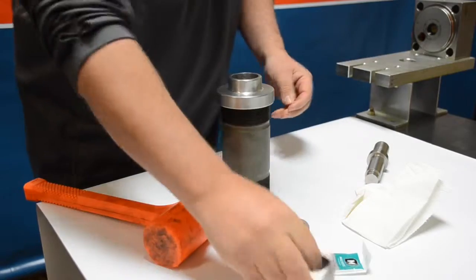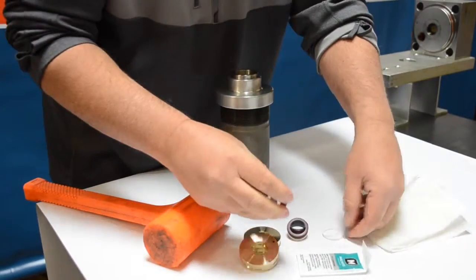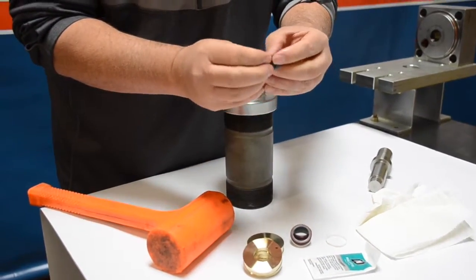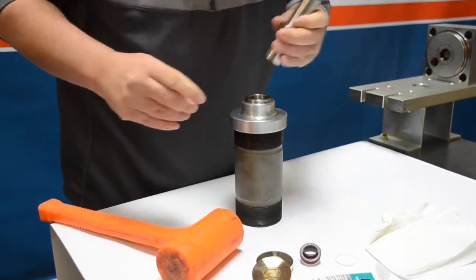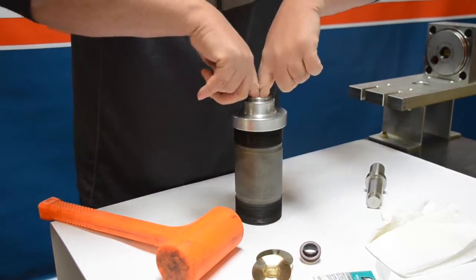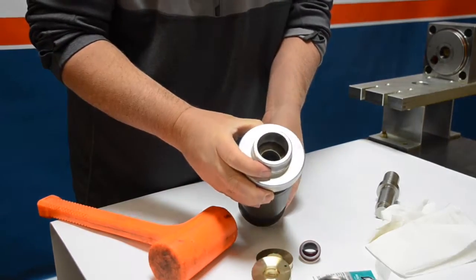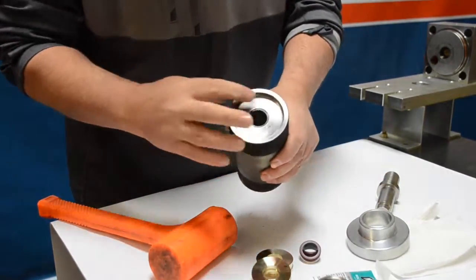Take the sleeve and make sure the flat side is facing down and the taper side is looking up at you. Take apart the seal, setting aside the hoop for now. Lubricate the O-ring again using the two-finger technique, spinning that O-ring between your hands, then put the O-ring back on the high pressure seal. Use the two-finger technique again to insert that seal with the O-ring facing down towards the center, getting it down as far as you can. Use the blunt end of the seal installation tool and press gently. With the hoop, sharp side facing down, use two fingers to get it down as far as you can, then give it a couple good whacks to make sure it seats. Take out the liner and check — it looks flush. Remove the cap and inspect the complete job, making sure everything is flush on both sides.